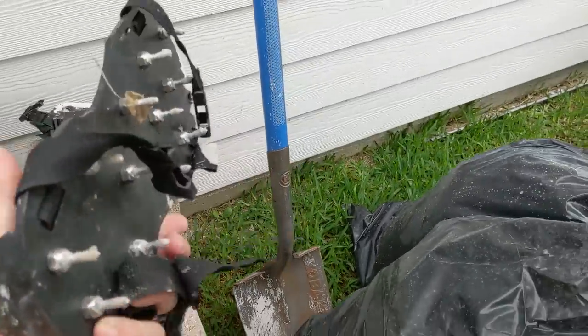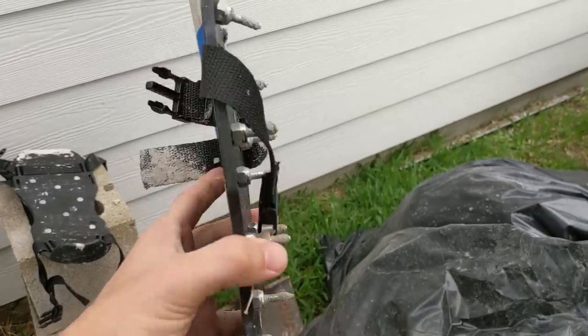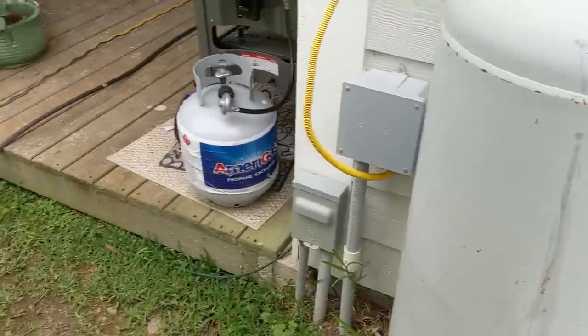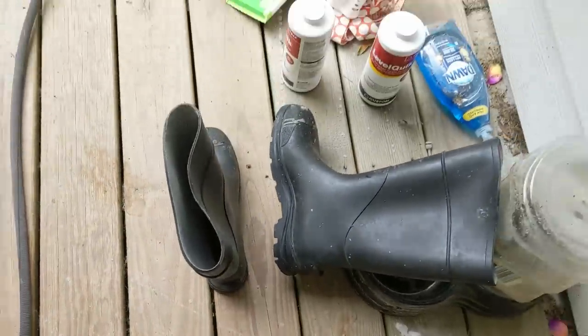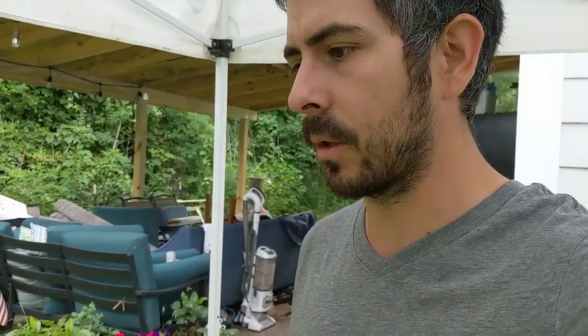I bought a pair of spiked shoes, but I used them a couple times on the first pours and they're kind of hard to wear, slippery, and they break — so I've just been wearing a pair of rubber boots, and they seem to work just fine. As long as you work quickly and are only standing in the wet compound, it's not going to be an issue. If you're doing more than three or four bags, you'll really need someone outside mixing so you have constant fresh compound to pour — otherwise, especially in a hot environment, it's going to cure really quickly and you'll be stuck.